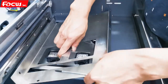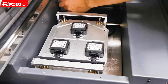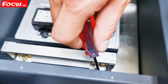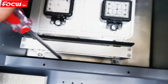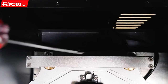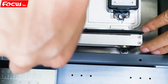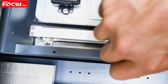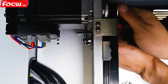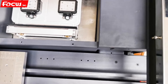Then we can take out the metal cover. We can see the caps here, and we can adjust the screw here. We can move the caps to front or back using the screws here and at the backside — two screws on each side. We can also move the carriage to front if we have the wrong front-to-back alignment. Loosen the screw, then push down the emergency button switch.